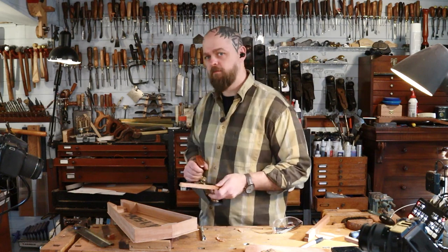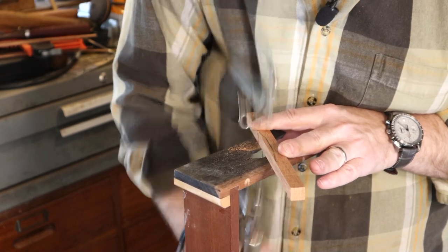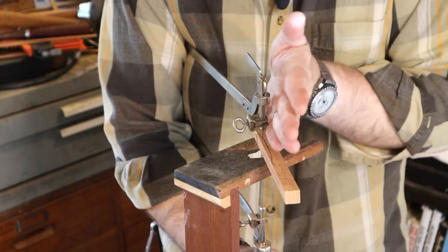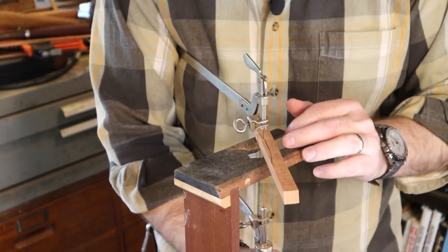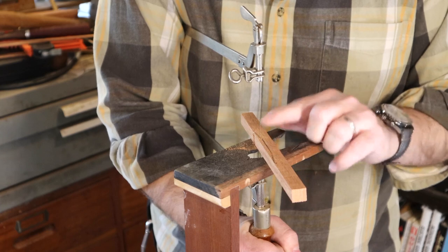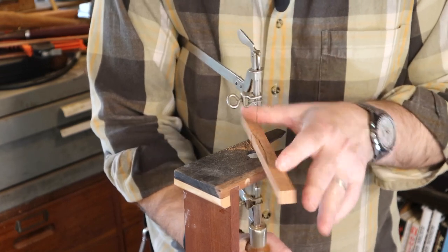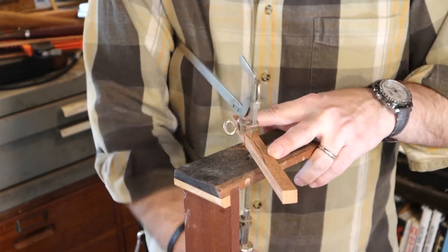Don't do what I do. Plan ahead. Public safety announcement. If you've got your fingers here on either side of the blade, if you hit a patch of grain where it's nice and straight, the blade can and sometimes does jump 2 or 3 inches ahead, specifically if you're doing spruce tops and things like that. The other option is you snap your blade, and this little bit that sticks in the front of the blade goes straight down and stabs through your finger. So keep your fingers behind or far enough away that's not going to happen, or, as in the case here, off the line.